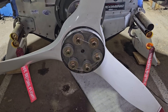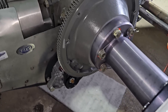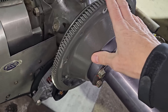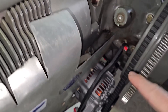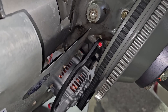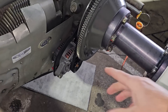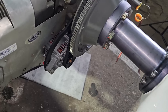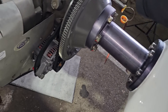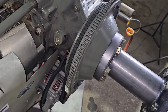You can see I've got the spinner off the prop. The next thing is to take the old prop off, and while I'm at it, I'm going to take the extension off and the starter wheel so I can get to the alternator down here and change the alternator belt. In order to change the alternator belt, all of this has to come off. I didn't do that when I put the new alternator on because I knew the new prop was coming, so now I'll proactively put a replacement alternator belt on there.